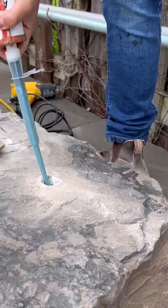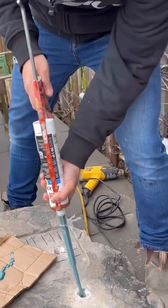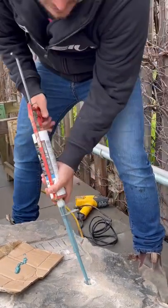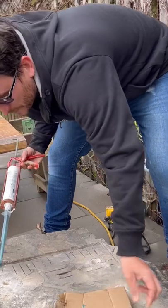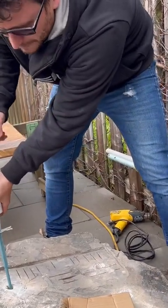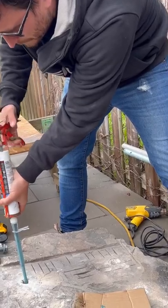So we fill with the epoxy resin. We only need to fill it probably three quarters of the way up for the threaded rod — when it pokes in, we'll have the rest ooze out. Make sure your holes are as clean from dust as possible after you drill, because dust has a habit of preventing epoxy from adhering to stone.